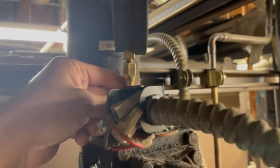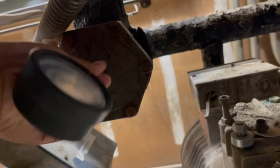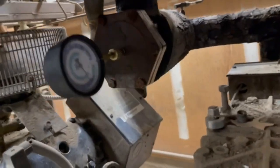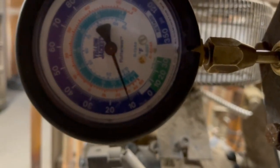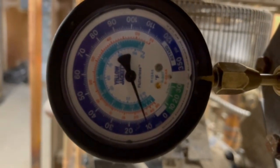I'm going to take that off and go around to the other side of the rack. Here's my suction filter, I'll put my low gauge on there. Right now I'm reading 10 psi - that's 10 pounds off. That's why I have to change it.